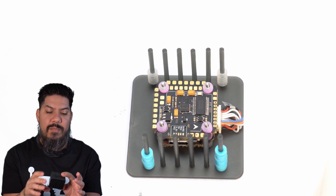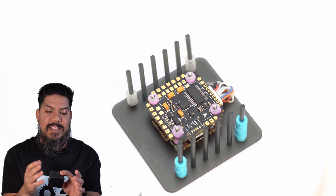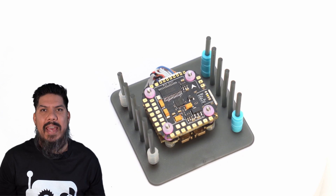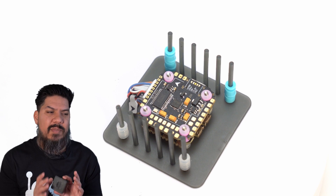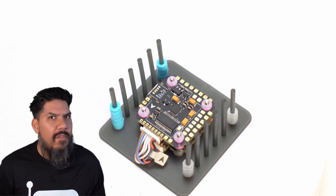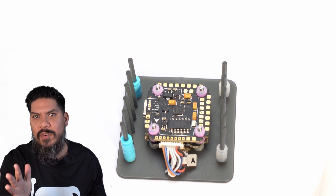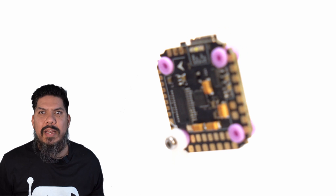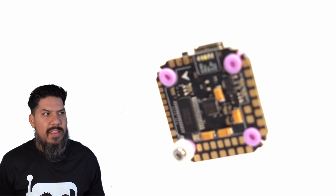You know the Open Racer that's coming up? That's got a Mamba MK3 20 by 20 in there, and they've just come out with a new version. This is the Mamba MK3 F722 mini stack, and they have finally done something I've been begging them to do for what seems like forever — which is to change the pad layout. That was the downside of these small Mamba stacks prior to this: trying to use those tiny pads. For whatever reason, even though they have four sides to work with, they would always put all the ones you need on the left side only. Why not spread them out? What do I need, an electron microscope to solder that thing up?